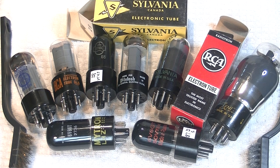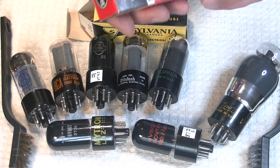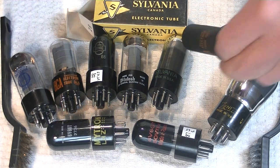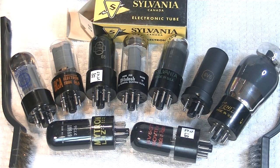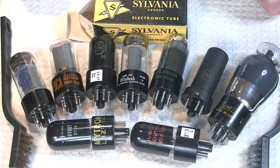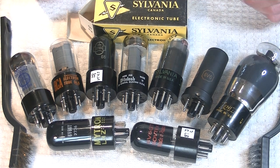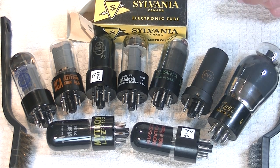Given the very long history of the 6V6, it's not surprising that a number of variants came along over the years, including the 6V6 metal jacketed version, the GTA with a controlled warm-up period, the 5871 and 5992 which are ruggedized versions for aircraft and similar applications, and the latest version is the 6V6S made by JJ Electronics, with a large plate plus higher plate and screen voltages. I don't have a JJ to test unfortunately, but if somebody sends me a matched pair, I'd be happy to.